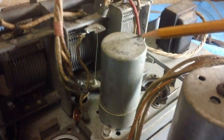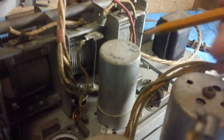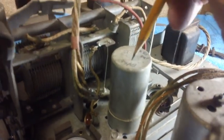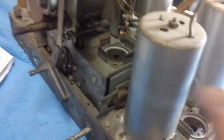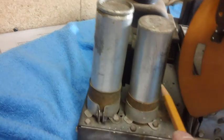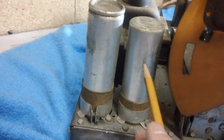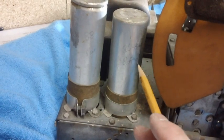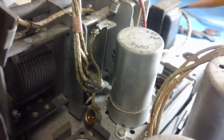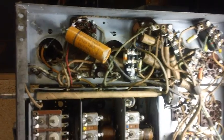The 1 and the 3 — or the 2 and the 3 — I won't know until Chuck Schwark's clearer drawings come in. There's not really a whole lot of difference between a 1 and a 2. They're both in this can, labeled 37A and 37B, next to the tuner. Over here is part 88 — an 8 microfarad, one can. This can is part 86 and 86A, which is the 8 and the 10. So: an 8 and 10 in one can, an 8-only in another, and a 1 or 2 plus 3 in this can.